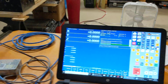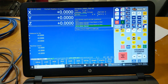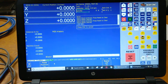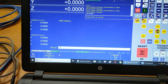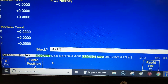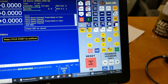If I come over here to the CNC Centroid Acorn — their software is called CNC12 — if I jump into an MDI I can give a command. Let's do an M3 with S500, and when I give it a cycle start, which I will do right now, here's what happens.